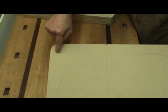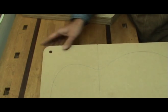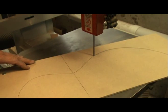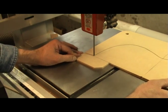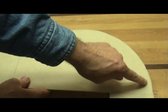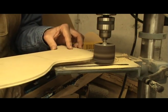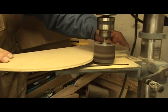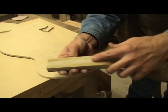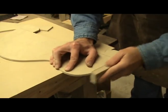You'll notice in the corner of the template there's a hole drilled, and that's for a reason. When I cut this out, I want to save this portion of the template — the rest is scrap, but I want to save that. The next thing I'm going to do is go to my drill press where I've got a little spindle sander, and I'm going to sand this right up to the line all the way around my profile. You can use a sanding block to come in and help clean up any edges that might have a little sharp tip, making everything nice and round.